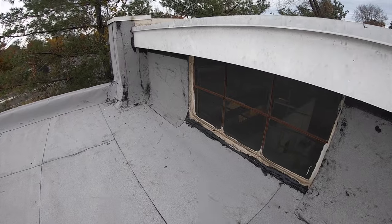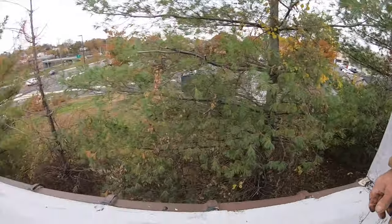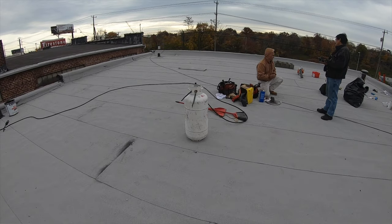We covered the chimney. See, the chimney is covered. Everything is clean, nice. And the roof is tight, very tight. This is never gonna leak again for the next 40 years. So, not a clean job, but it's a job that any owner can do. Anybody can do it. It's a peel and stick. The little bit hard part is the transitions to a wall or to a parapet wall. That is what makes it a little bit harder. You have to work at it. But the rest was so simple and easy.